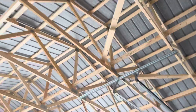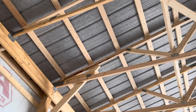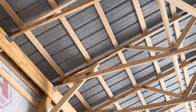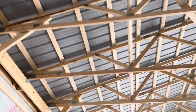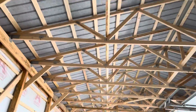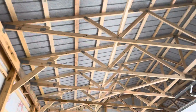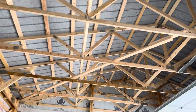Like I said, drip stop metal here — that comes with a 20-year warranty. It's got a fuzzy felt-like texture and comes pre-assembled to the underneath of the metal. You can use that or you can use a vapor barrier. No extra labor because it comes pre-applied to that underneath steel, which makes it nice from a labor perspective.